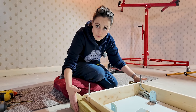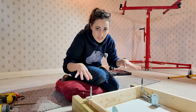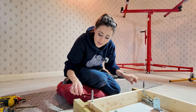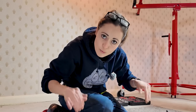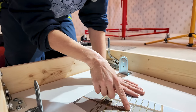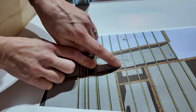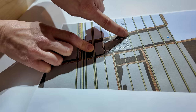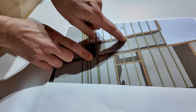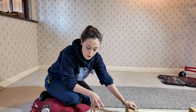Now I've got my framework temporarily surrounding the loft ladder with an overhang of three inches on either side on the hinge side. The reason for that is when I screw this in and put it up there, the overhang will rest on top of the joist so it won't fall through. While it's up there, this framework - the white framework on our SketchUp diagram - will show us where to cut on top of the joists.